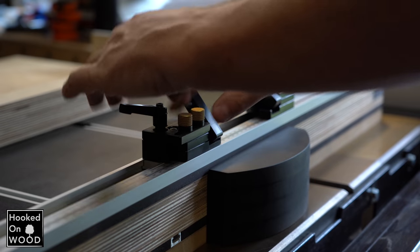When you have to drill a hole at the edge of a piece of wood, the fence can come in its way. However, I use this in combination with different flip stops and I really like this combination. If you drill holes on the edge of a piece of wood pretty often, I would consider other options, or cut a V shape in the fence so the drill press chuck can go lower. My drill press has a laser pointer, making it very easy to line up a piece of wood. I do not need a scale or ruler to set up my drill press — it is easier to mark where you want to drill a hole and use the laser. And when you have set up your fence and flip stops, it is so enjoyable to make small production work. It is very accurate and easy.